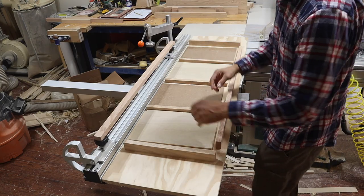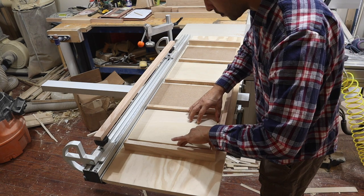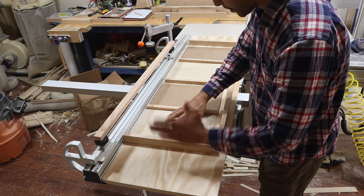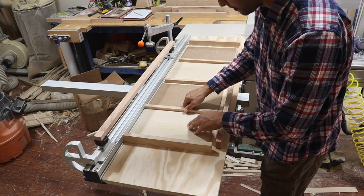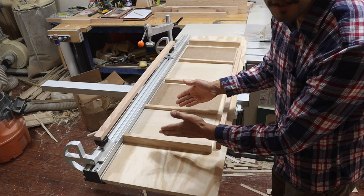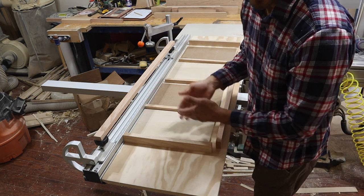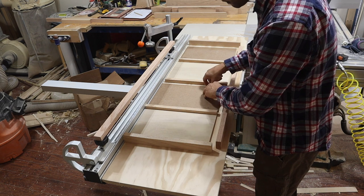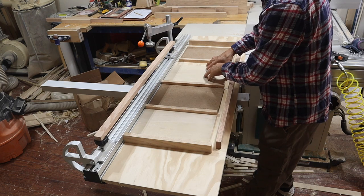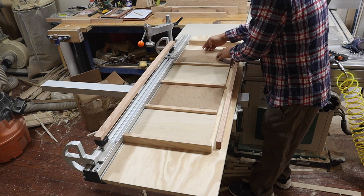The reason I have it up against here like this is I notice a nice straight surface, and this is a nice flat surface. So what I want to do is just take the scrap like that. This is one of the comic books. I'm going to butt that up against there. The spacer is going to go in between, and now I can butt it right up against there tightly because this is oversized. So there'll be a 1/16 of an inch gap on either side when the actual comic book goes into the workpiece. So butt the next one up against it, and this is how we're going to pre-assemble everything using these as spacers.